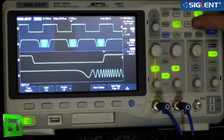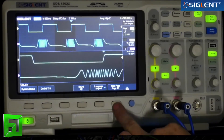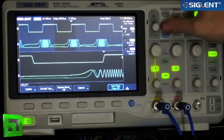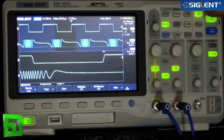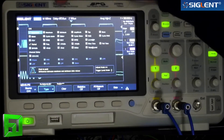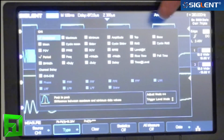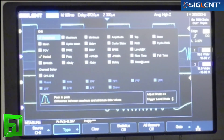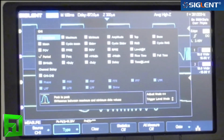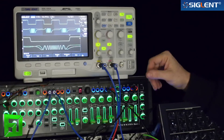Some other options you can jump into are in the utility area — this controls whether your sounds are on, giving you audio feedback as you click buttons so you know you've pressed what you need. You can also go into measurement modes. In measurement mode, you can pull up things like peak-to-peak, maximum, minimum, amplitude, and there's some interesting math on here as well. You can check out fall time and rise time, which is really great for checking out envelopes or calibrating an oscillator.